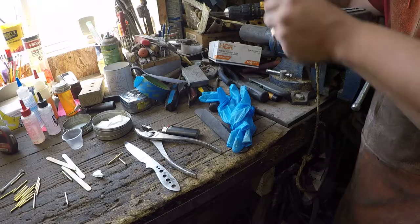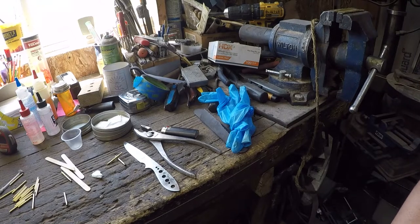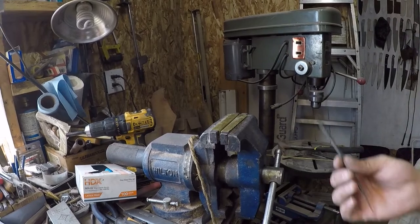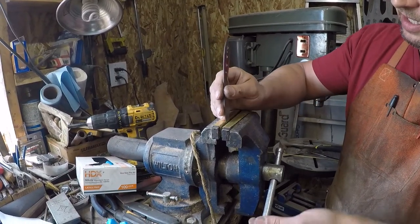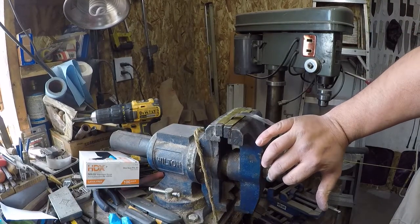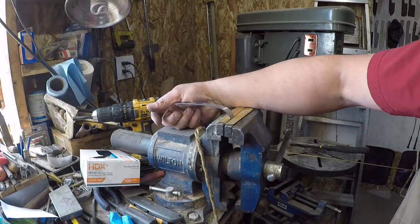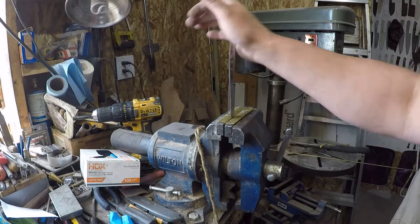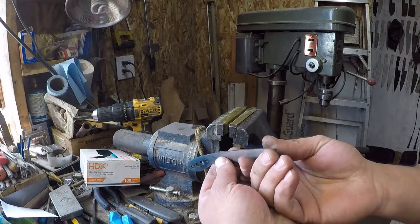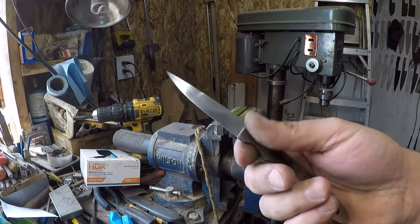Not that the 90-degree flex test is the end-all be-all of testing, but it is kind of cool to show that you can make steel do some pretty abusive things and still be okay. So the standard is, clamp it up a third of the way on the blade, and then bend it over. Boom, 90-degree flex test. Big deal, right? Let's go the other way. That's 90 degrees the other way, right? And then we can straighten it back up. Since it's kind of on the light side, we'll straighten it back up. Heck, you can straighten that thing right back up and keep using it, okay?